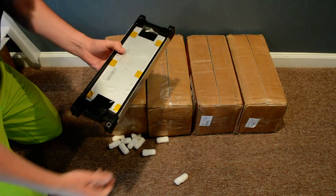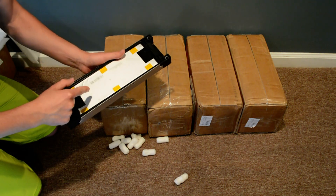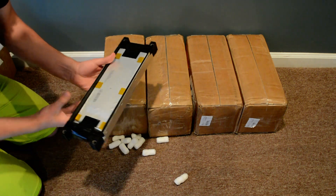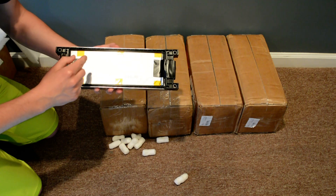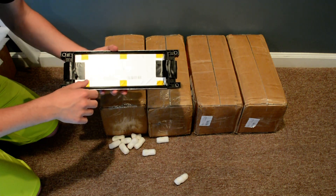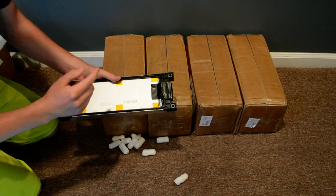Each of these cells are 3.6 volts. Currently these battery cells are hooked up in parallel, but I will have to take all of them apart to change them to series, because I'm going to have a 96 volt setup. I need to make sure they're configured in series and not in parallel.